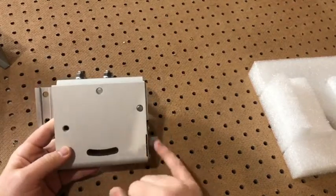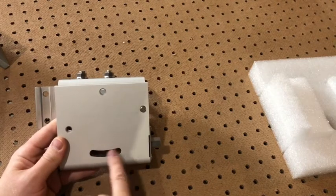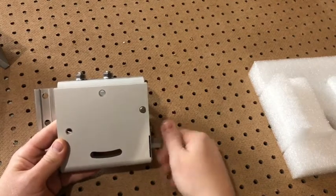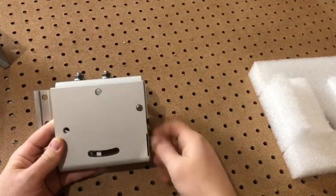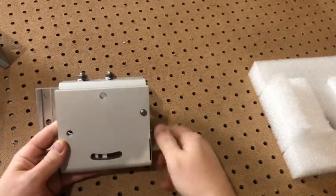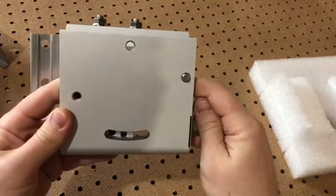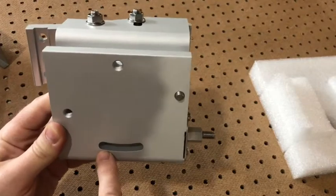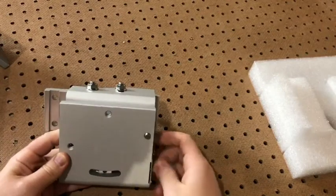The next step is to position the vertical bar so that the screw hole is within view of our slot here. I'll simply turn it by hand. You can see here that it's already in view — I like to bring it just a little bit farther until it's at the midpoint.